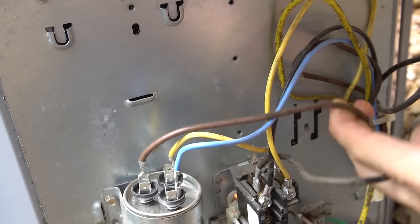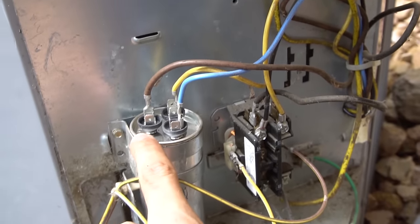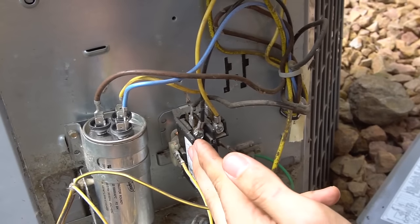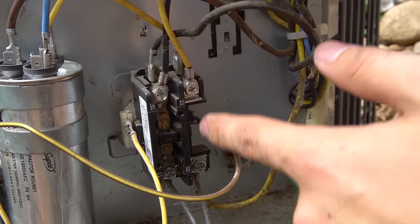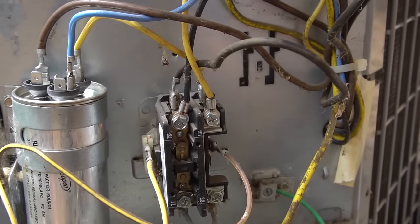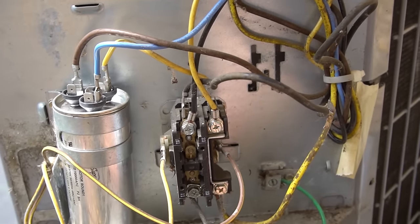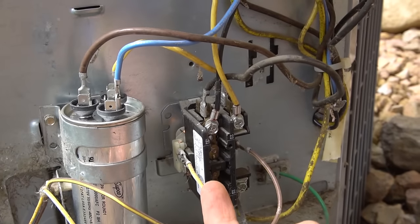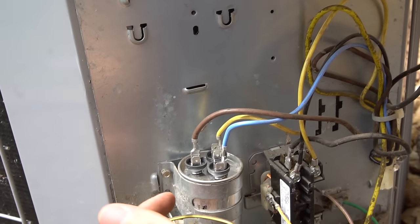The way these motors are wired is very simple. On a three-wire motor, the brown wire is always going to go to the fan section on the dual run capacitor. The other two wires — the yellow and the black — simply go one on each side of the contactor. On one side of the contactor you have the plunger where power gets interrupted, while the other side is a straight bar with no interruption — there's always 120 volts there. So the yellow wire goes on one side and the black wire goes on the other side of the contactor.